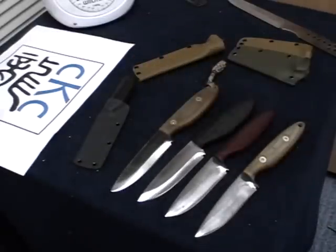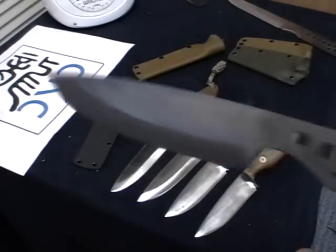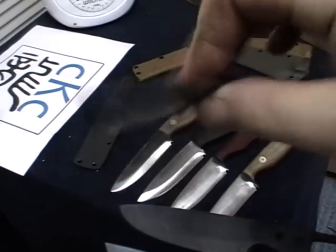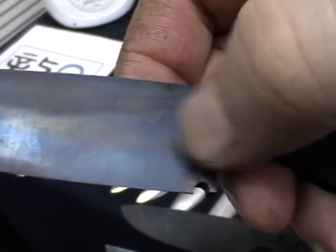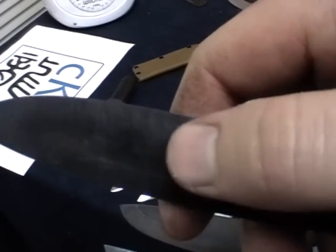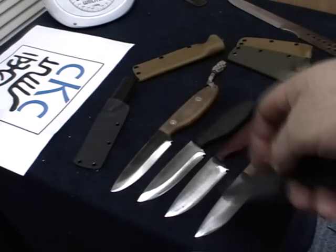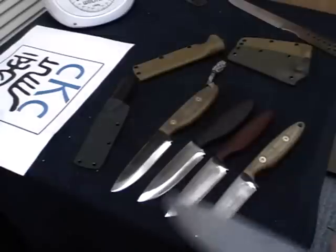Out of this batch I've got a couple of the 2.1's with the smaller blade in the heavy convex, and another one of the original 2.1's in the higher convex. You can see the grind line only goes up to there — it's really more like what people call a saber grind. That can still be finished with a heavy, durable edge as opposed to the super lean slice on these. So these are available.